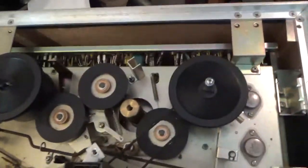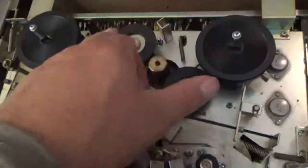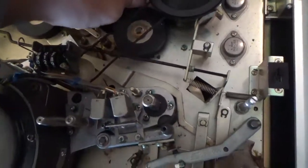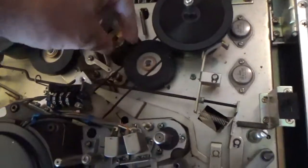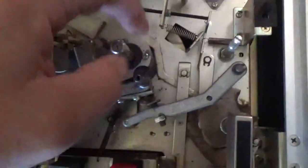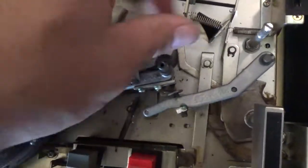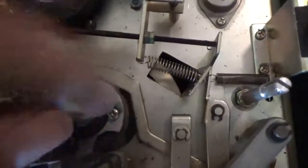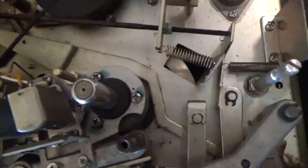The inside is just like your standard reel-to-reel tape recorder — got your idler wheels, everything appears fine and solid. This is your drive motor, the main one. This is the capstan; I think it's motor driven or it might have a belt. You can see the flywheel right there underneath the spring — it turns with the capstan.